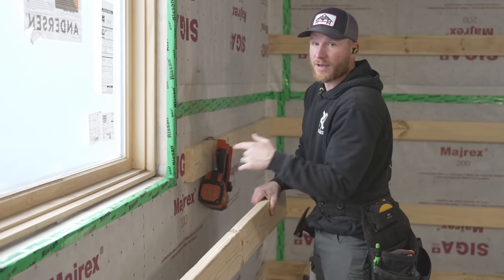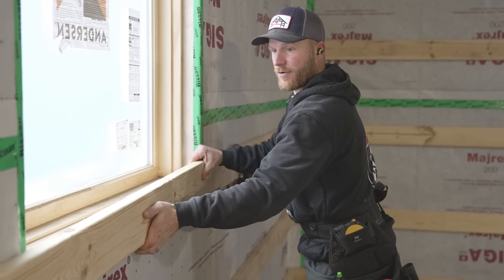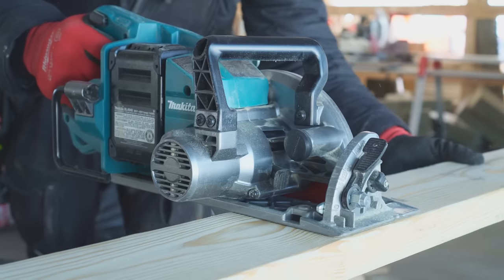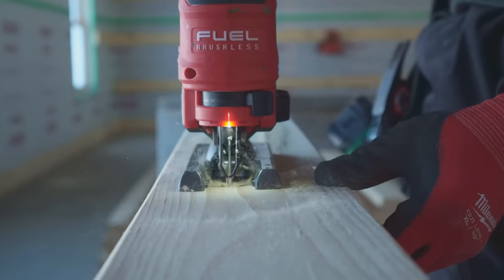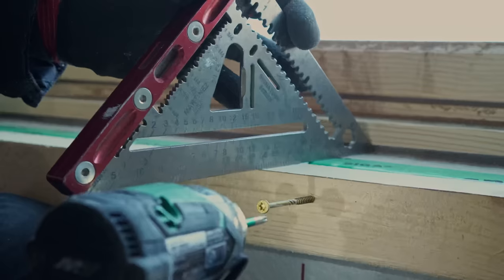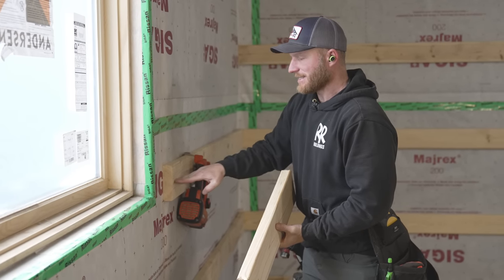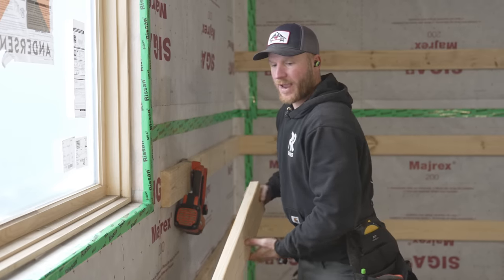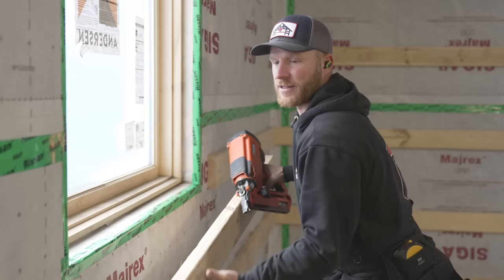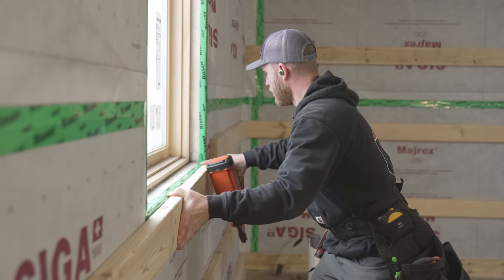This location is special — this girt goes right through my window. In some locations if we're still going to have enough material on our board, we'll just cut it out. But in this instance, we're going to run this right flush at the bottom and fill in this section with a little bit of framing. The important thing is this girt is not a drywall joint girt — the drywall joints will be elsewhere, so it's just going to span over and be a nailer for our drywall.